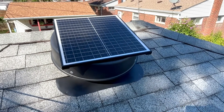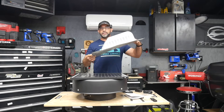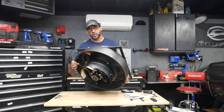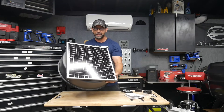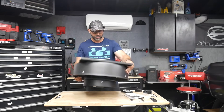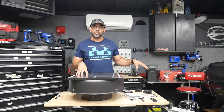Got another product from Vivor here — this is their attic solar fan. For any guys that have standard vents on your roof, whether it's your shop, garage, or house, you can now upgrade those to the solar style. This has got a 45-watt solar panel on the top and a built-in fan, about 12 inches in diameter, and it's going to cool your attic, greenhouse, shop, or garage better than traditional vents.